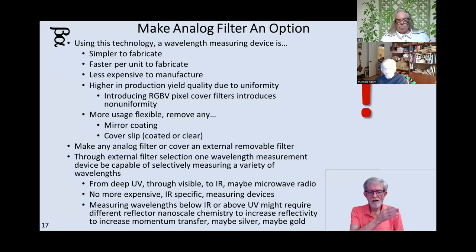The reason is all the readout is digital, so you should be able to read from UV down through visible infrared, maybe even microwave radio wavelengths. You wouldn't need a special device just for reading infrared. Right now, if you want to read infrared, you buy a bolometer — as light hits the pixels, the pixels act like little resistors, and you judge the voltage going through as the brightness of the infrared. If you could read infrared directly, you wouldn't need to go to FLIR and spend a lot of money for an infrared-only camera.